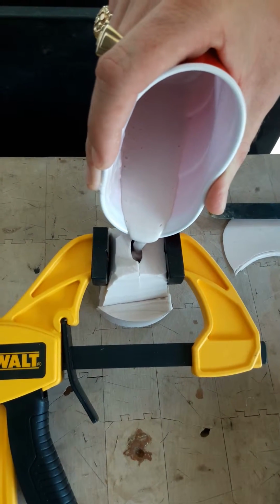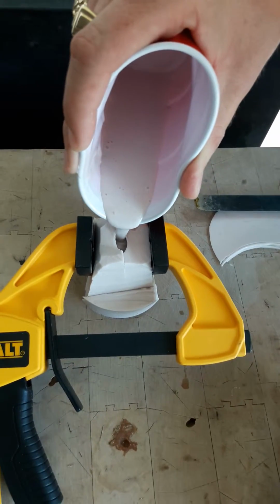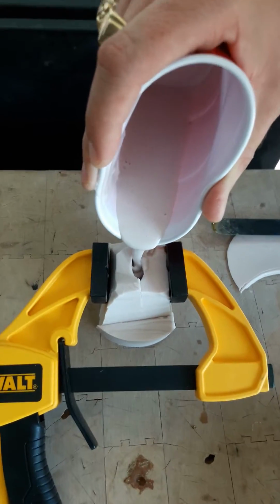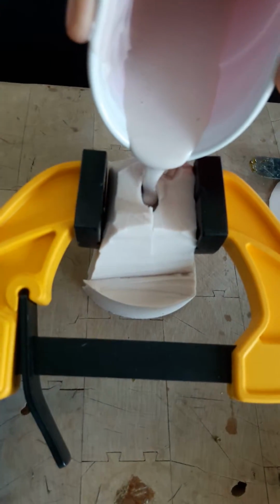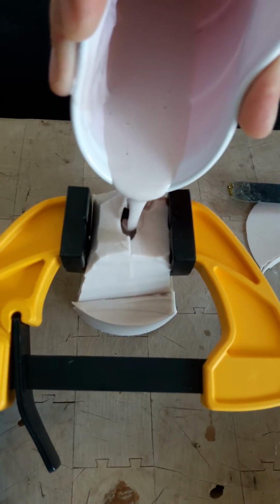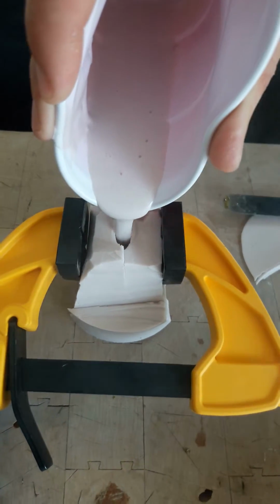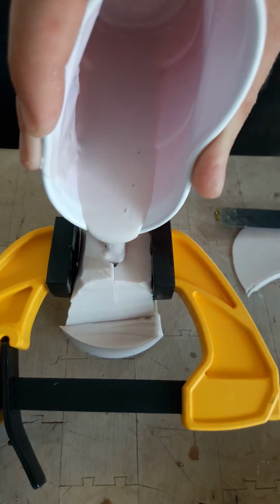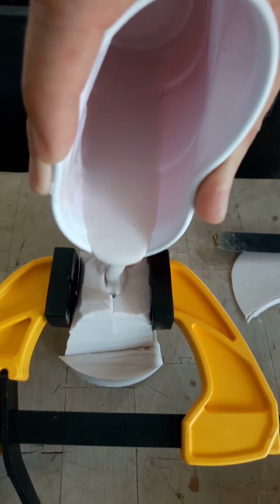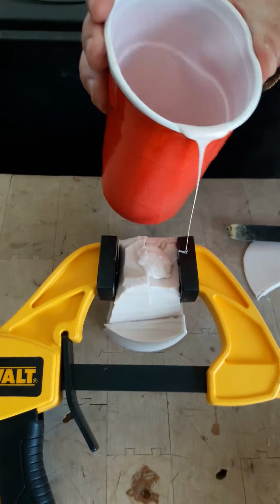One of the things that we want to do here is pour in the same place. Air pockets could get trapped in here. The silicone is really, really dense, and eventually it'll affect your print if there's air bubbles in there. So we'll see if we got enough here to fill this mold up, and it looks like maybe we do.